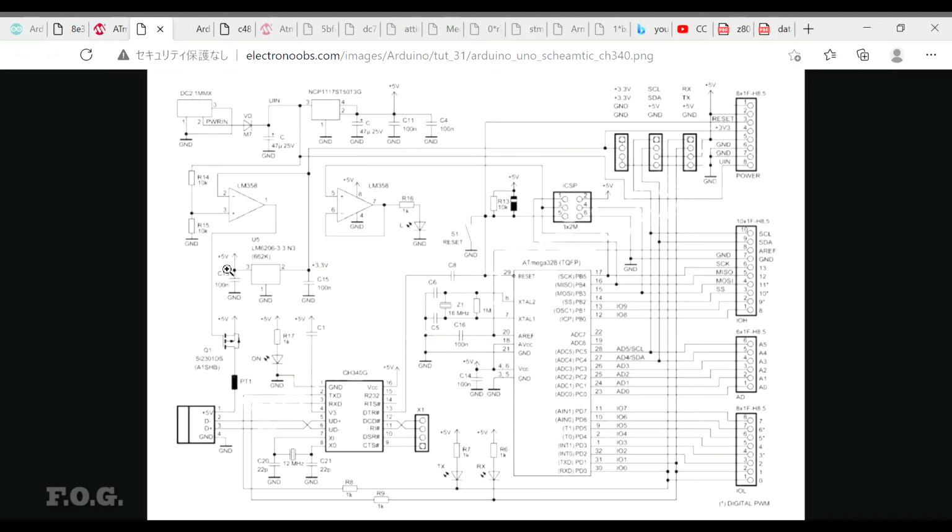The diagram that I have here is pretty relevant, I believe, to this board I'm holding. There are a couple of different versions of this board, and I'll explain that in a second. But fundamentally what we have is a chip here, this CH340G, which is, as far as I know, a hardware device, possibly who knows what's going on inside, which presents a USB interface and converts it into what I would call an RS-232 Rx/Tx port. So you can get onto your computer, open up a terminal, connect to this port, and send and receive data from this port. And it has all of those classic and typically highly unused little flags such as DTR, data terminal ready, RTS, ready to send, I believe, etc., etc.